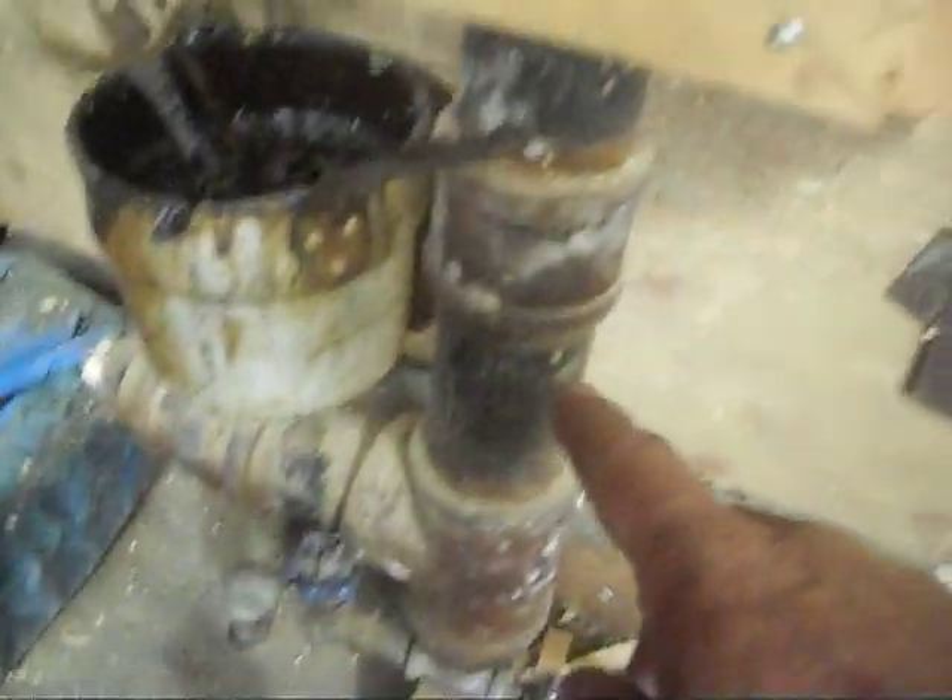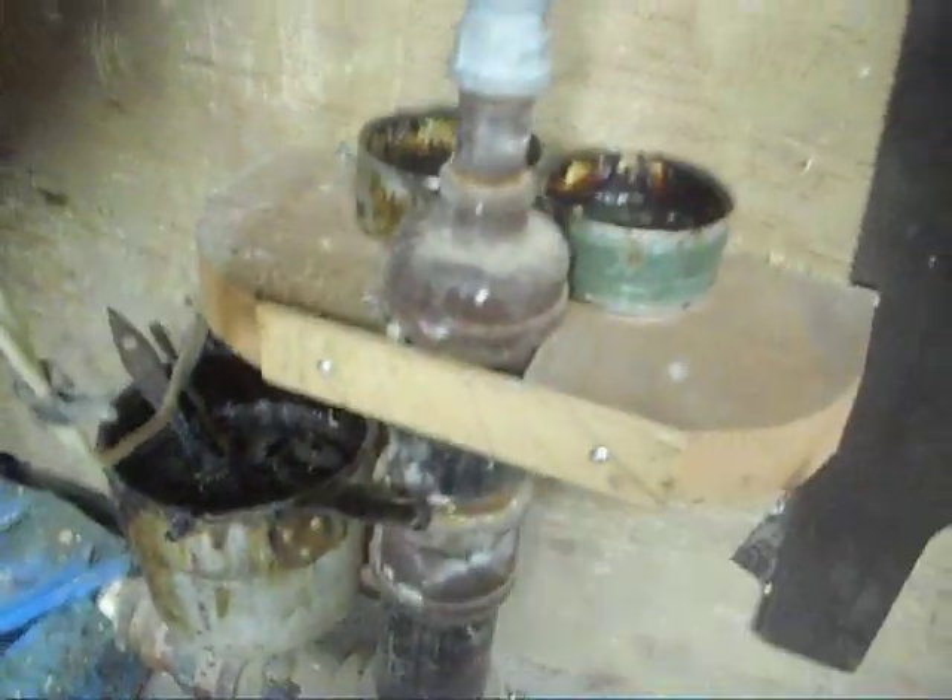So the boiling chamber, the steam chamber, and then the hose up and into my steam box, which in this case is a piece of black plastic PVC pipe with chopsticks run through the holes on the side to keep the wood elevated so steam surrounds it.